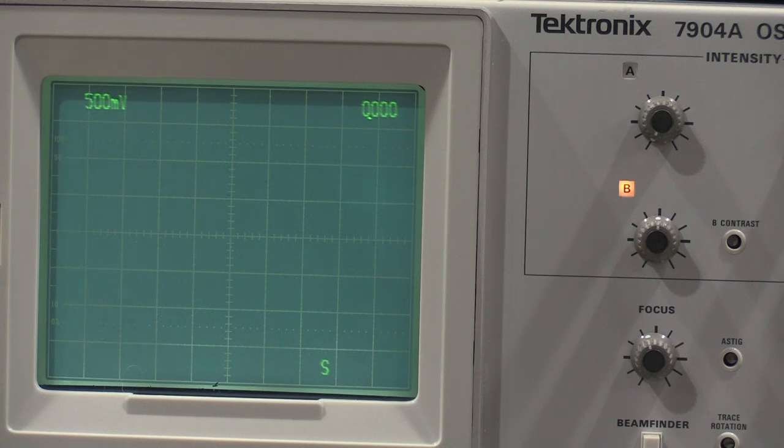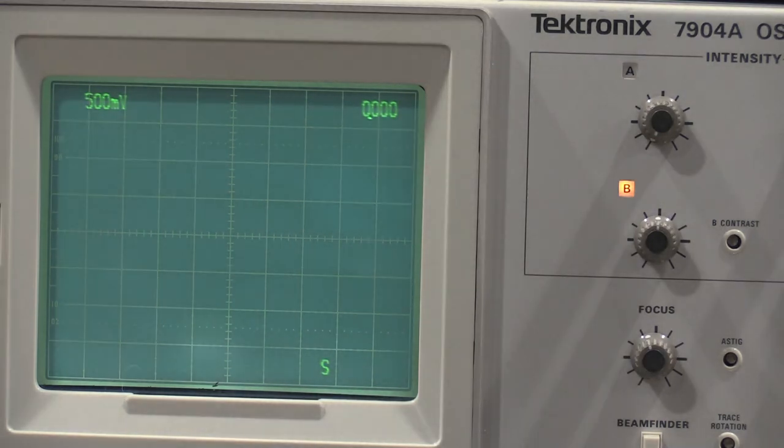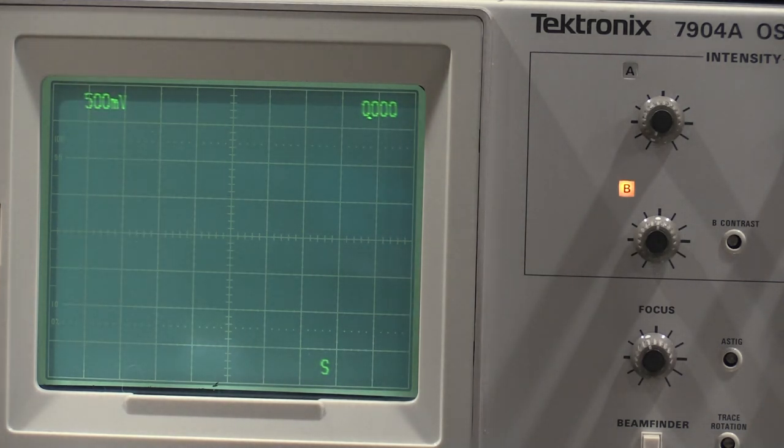Given that we're going to dive into the troubleshooting process, obviously first thing we're going to check is power rails. That's usually step one of troubleshooting. Thou shalt check power rails, because if we don't have the voltages we need, obviously the unit's going to be out to lunch. If the power rails are okay, next thing is checking the main oscillator, that it's relatively in spec. If the crystal's off, I can't expect the unit to do anything. Or if the main oscillator's not running, we'll have a situation similar to the TG501 I fixed in a previous video where the main reference oscillator was out to lunch.